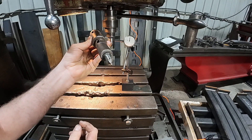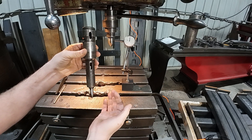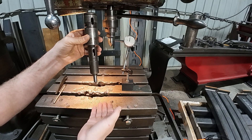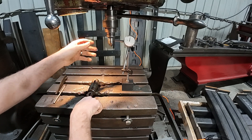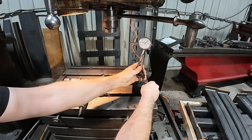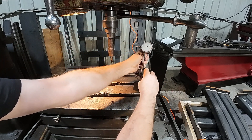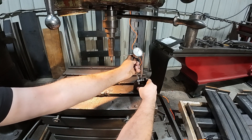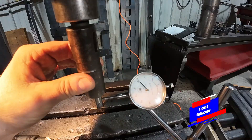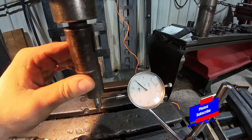This is holding the center drill, and I use this because then I don't have to change the height of the machine to drill multiple things. I can center drill and then run a regular taper drill because they're longer, so I don't have to change the height as often. Let's find out what our runout is at the bottom of this guy, because now it's got me really curious. 50 thousandths without even trying it.